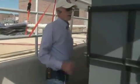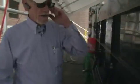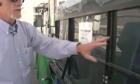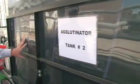Comes into the second agglutinator. Here again, very similar to the first. Travels down here, up this chamber, down this chamber, up this one, down this one, then up the finals. And as you can see from the first chamber on the other side over here, as we keep moving along, it gets progressively cleaner. Okay? We're not finished at this point, but we're getting very close.